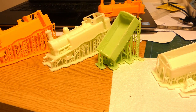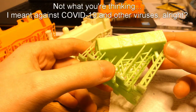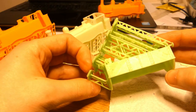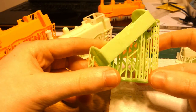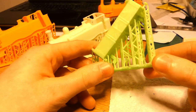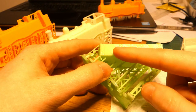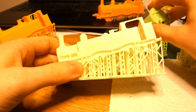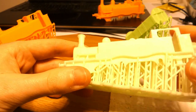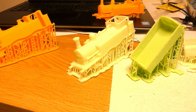These two prints are an example of me being a massive spanner. Your FEP film is one of the few areas where you don't want protection. This surface is pretty lumpy — I forgot to remove the protective film that comes on the FEP film. I'm amazed it actually stuck to the print bed because the protective film isn't anywhere near as frictionless as the FEP. But the light transmission was nowhere near as good, so you end up with all these lumps and bumps on the side. These prints are unfortunately unusable.